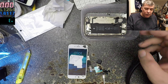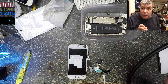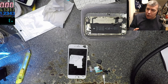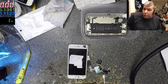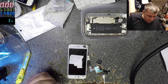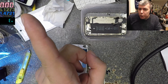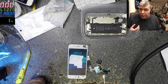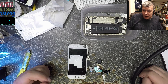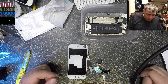So you see, in this case the freezing spray was too sensitive to heat — it didn't give me a clear idea of where the fault was. With the petrol I was able to find the problem on the other side of the board. It's working fine, charging fine at 1.4 amps. I'm happy I could help the man — he's trying to fix things and earn some money, so it's good we can help each other.